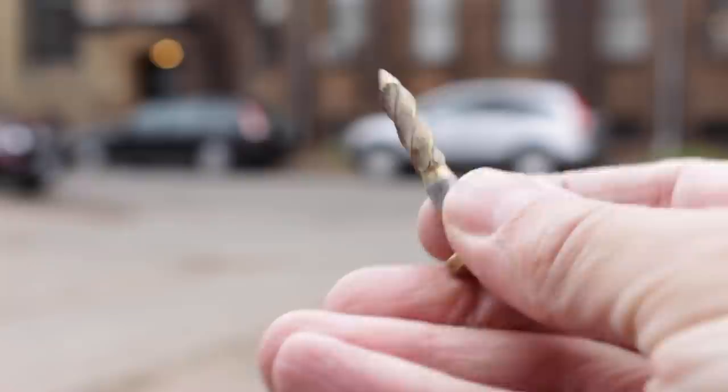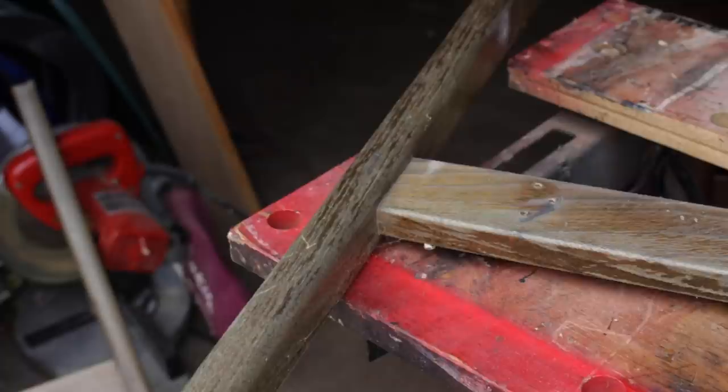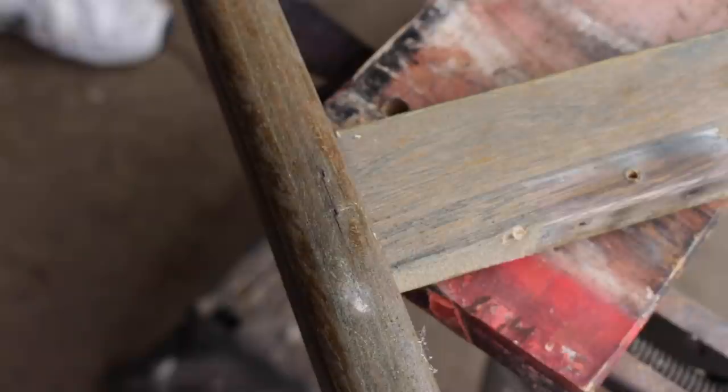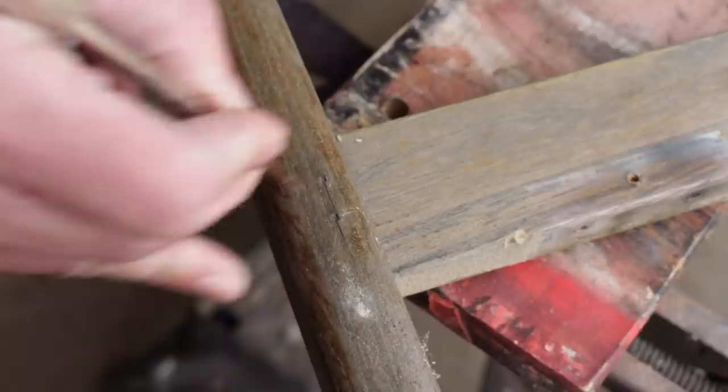All of the joints were loose, so I wanted to get those apart to be reglued. Unfortunately, they also all had nails in them. I see nails in the joints of chairs a lot, usually as an attempt by a home handyman to tighten loose joints when the glue has long ago dried up. But these appeared to be original from the factory.